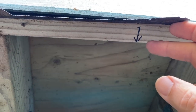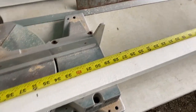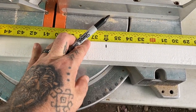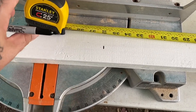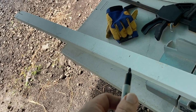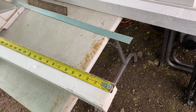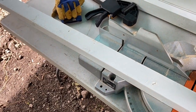I'm set up on my chop saw. The vertical pieces are going to be 36 inches, which will leave a small gap — maybe an inch or two — off the ground, because I don't want it to actually touch the ground. I'll cut a 36-inch piece from each end of the board, and I want the painted ends to be the parts close to the ground to help prevent moisture from getting in. The piece left over in the middle will become the cross piece that goes between the two uprights.